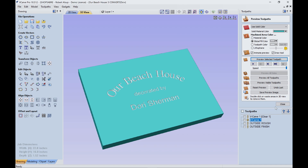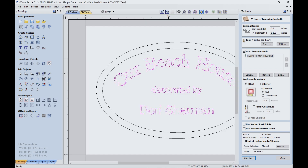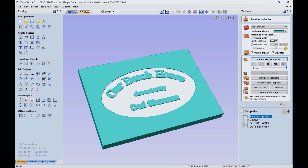Let's go back and open that up — there's where we define our second tool. Let's change our selection. We've picked the letters. I'm going to hold the shift key down and pick that oval too, so I've added it as a selection. We'll reset our preview. This time we get a toolpath with a straight bit, so that's cutting that pocket out about an eighth of an inch deep, and then we come in with our V-bit. Now that's a totally different effect — those letters stick out, and that's really what I wanted on this particular one.